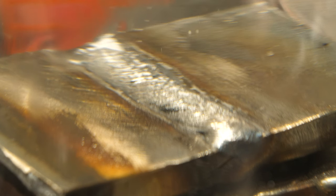The second weld I did held up. It has the same indications as previous 7018s where at maximal load it does start to crack slightly and tear at the toe line. The second one did not fail. I assure you that there was hydrogen in it. The first one failed, but there are a couple of reasons for that. Let's look up close - this thing welded like absolute dog turds.